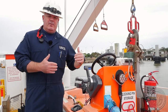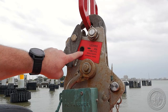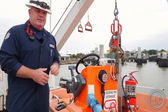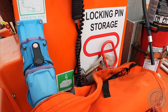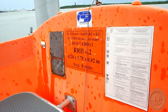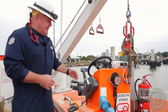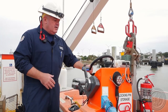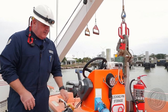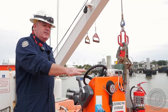Now that we're getting ready to get in the rescue boat, we want to verify that the release mechanism safety pin is installed. Without this pin in here, I'm not getting in the boat. We also want to make sure that there are markings inside the boat for our fire extinguisher, and our data plate is located up forward — we'll verify the information on there. We'll also verify the retro on the top side, that everything conditionally looks good, that steering works, they have their safety lanyard, their engine kill switch, and verify any required equipment is actually placed on board.